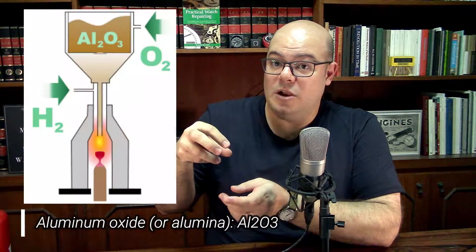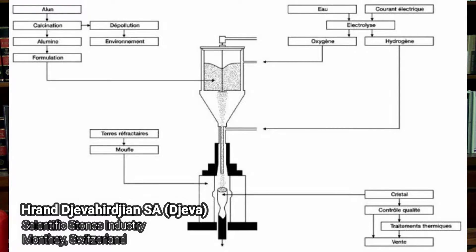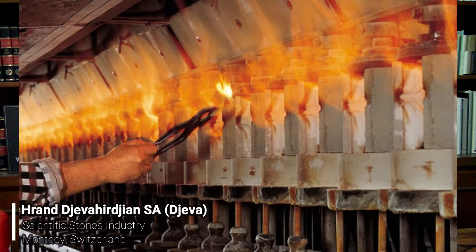Ruby is actually a red sapphire, produced by the addition of small amounts of chromium. You can add these materials during the making because the sapphire or rubies used in watchmaking are artificial — they are man-made materials, made by a process invented by a Frenchman named Auguste Verneuil more than a hundred years ago. The process is basically the melting of aluminum oxide powder submitted to a very high-temperature flame, which starts dropping over a base and forming a bigger and bigger crystalline piece called the boule. It looks like a small bottle.